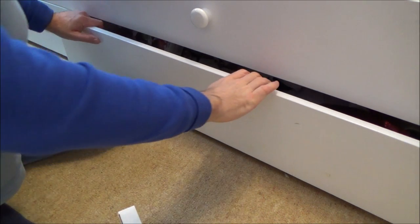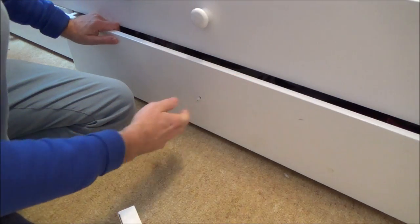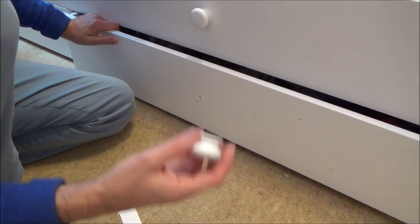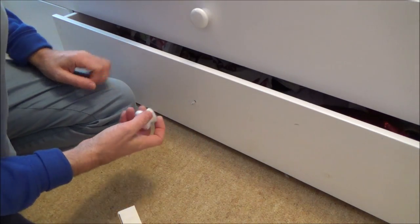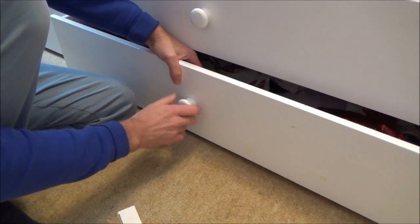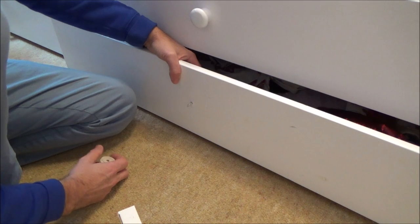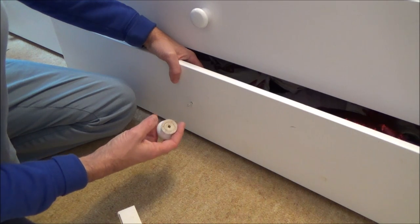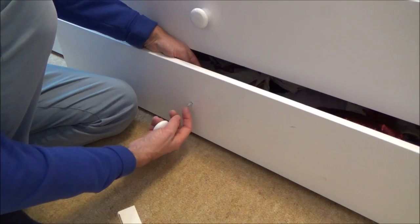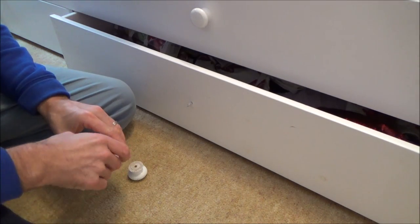Next we have a pull-out bed with drawers underneath for storage. The problem is the drawers are already quite hard to pull in and out, and with stuff inside there's a lot of strain on the handles. It should have two proper pull handles but just came with small screwed-in ones. The handle no longer grabs the thread — ages ago I put sellotape around it which lasted about two seconds. I could use a thicker screw, but I'm going to try one of these little pin plugs instead.